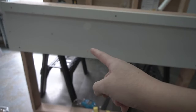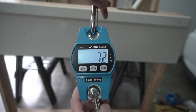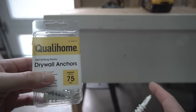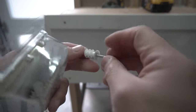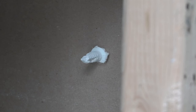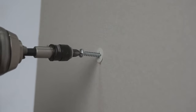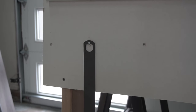I made a mock-up right here made out of two-by-fours and a half-inch drywall. I'm going to be using this hanging scale so we can check how many pounds each one can hold, and we'll go from there. First one to the plate is this Quali Home self-drilling plastic anchor — the one with the little screw type.